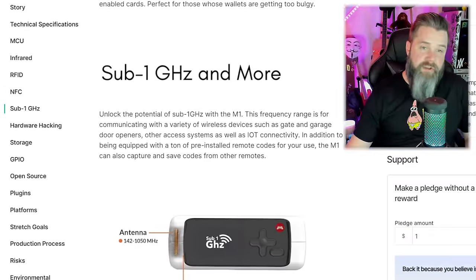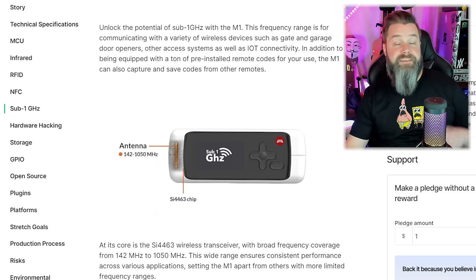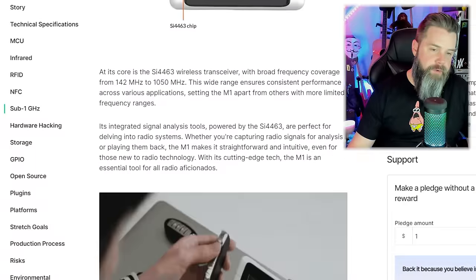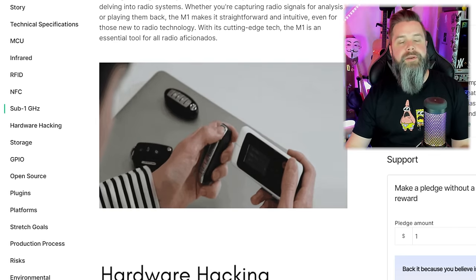All right, sub-gigahertz and more. It uses an SI4463 instead of a CC1101. Now the SI4463 and the CC1101 both have the same output power at plus 20 dBm. What is different is that the CC1101 does support variable packet lengths. I have no idea if that actually matters, but if you do know, leave a comment down below and let me know. All right, moving on. And copying car keys. Come on, just stop showing copying car keys. We don't need it.